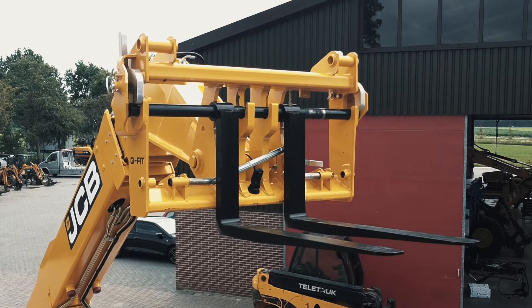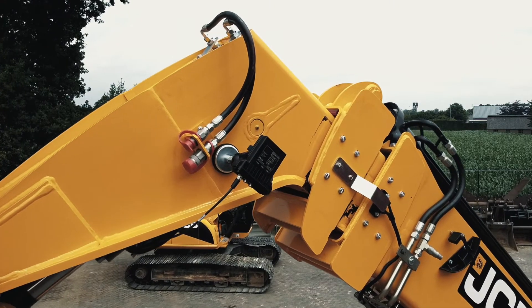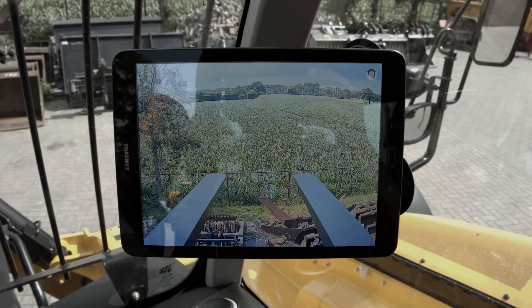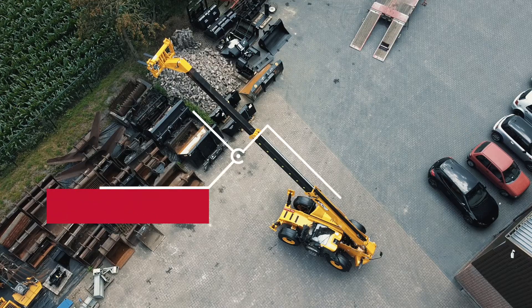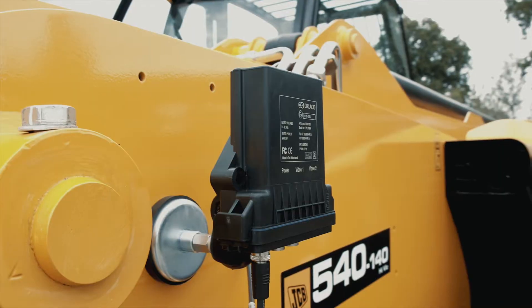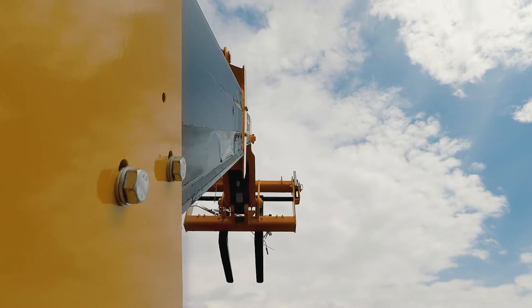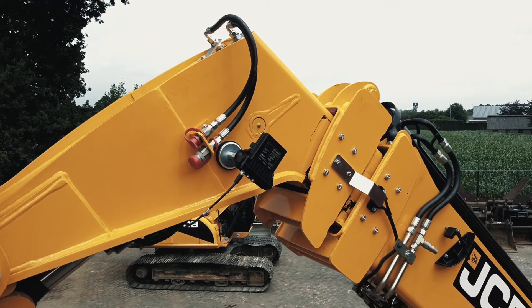The camera system includes a compact EMOS Ethernet camera, two Ethernet wireless sender receiver units and an optional tablet. The technology enables wireless digital video transfer via Wi-Fi. The receiver is installed near the cab, while the camera and transmitter are mounted at the end of the telescopic boom on the tool carrier.